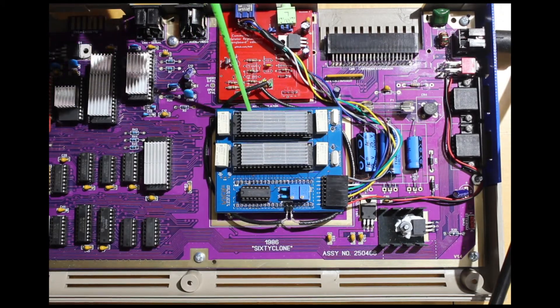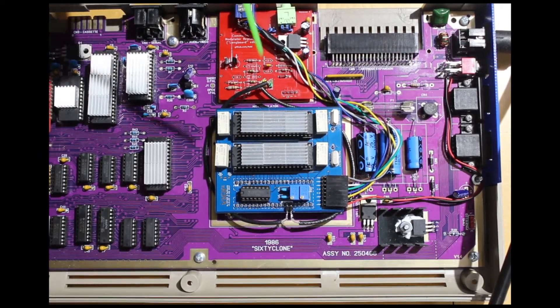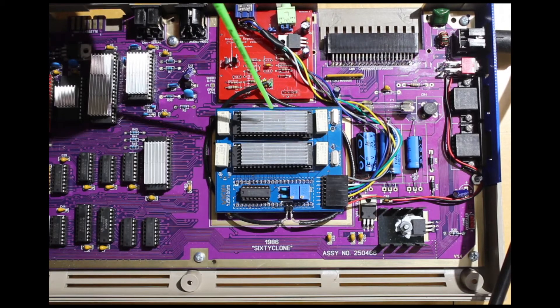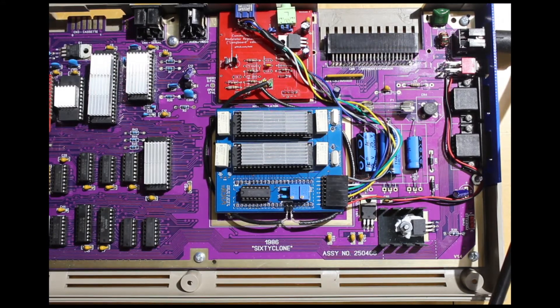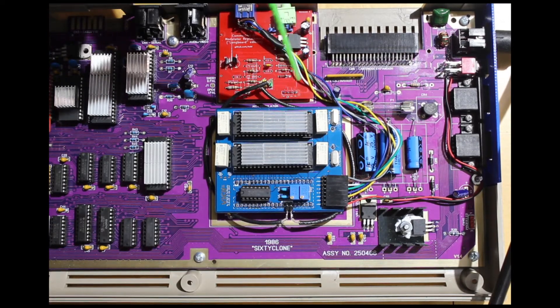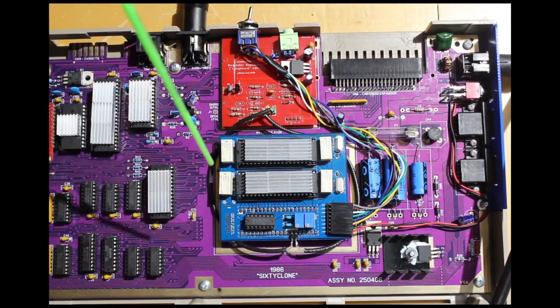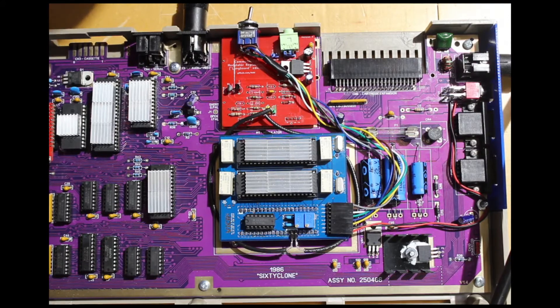This board is super cool. It's from perifractic and someone else who worked with them — Retro Recipes is selling this VIC-2 Squared, which is a combination of the LumaFix project as well as four relays. So you can switch back and forth between NTSC and PAL, or if you really wanted to rig up two different generations of VIC, you could do it that way too. But the real purpose is to have NTSC and PAL in one machine. This is a great board and easy build — it's really just one logic chip, an LS-14 inverter. The way the LumaFix works, you induce an opposing signal to cancel out any noise you're experiencing on the analog video coming out.